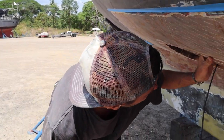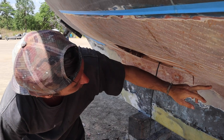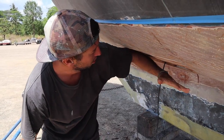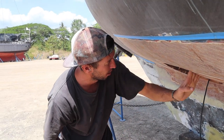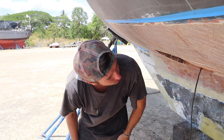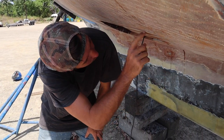This other hole here I'll just have to make it bigger, so we get underneath the structural beam — underneath the stringer — so it's much easier to fit the bits of wood and have them in there rather than butting up to an edge like this. I've just got to cut this back again. The other guys are here now, fitting the wood pieces and cutting them up to replace the planking that was damaged. Progress — absolute progress.